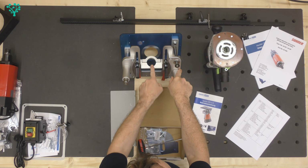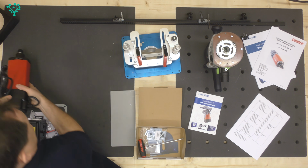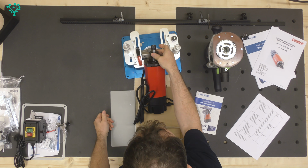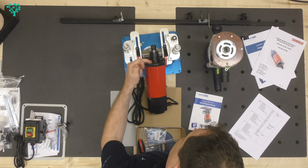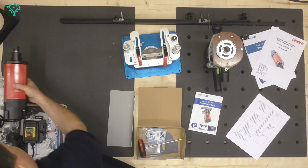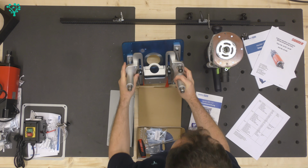That's a 43mm fitting, and that's designed to take a spindle of some sort with a 43mm collet here, or a neck on your spindle. So any router spindle that's got a 43mm on this will fit inside this router table for the OFL-K3. 43mm is industry standard. So when you buy a CNC machine, you're putting your spindle inside there, it's 43mm. So you've got a lot of versatility about what you put inside here.